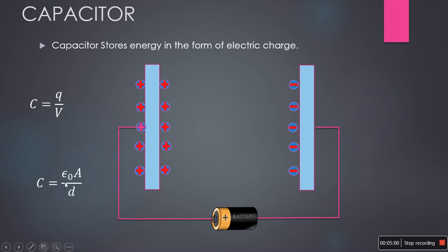I can improve the capacity by increasing the area of the plate — more area means more charges can be stored — and by reducing the separation between the two plates. If I reduce the separation, the negative ions can produce a diverting field for the positive ions and effectively prevent them from repelling among themselves, so capacity improves further. But there is a limit on this separation. We can't bring them too close or make it zero, because after a certain distance these charges may fly over and reach the positive charges and get neutralized. That point is called breakdown of the capacitor.